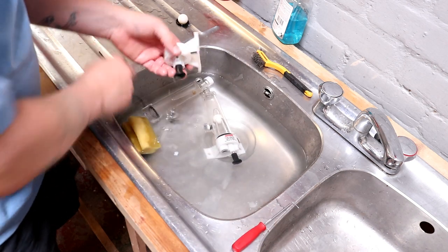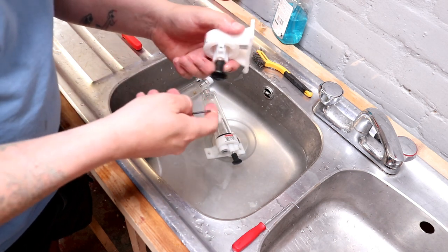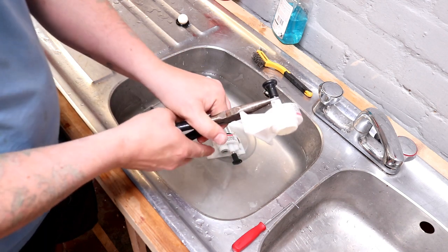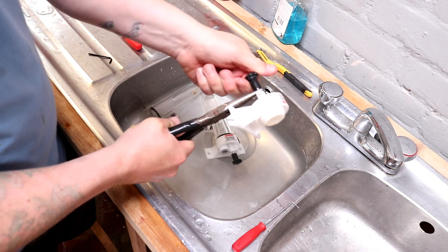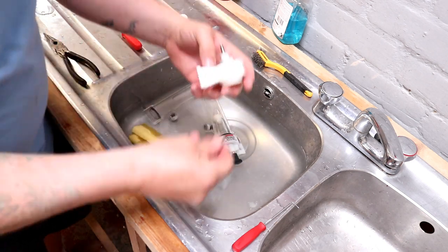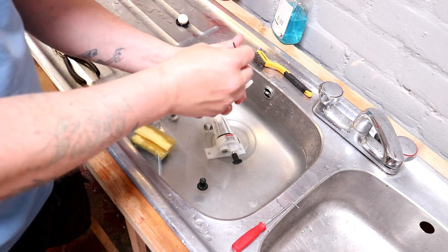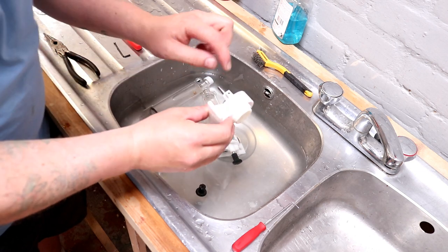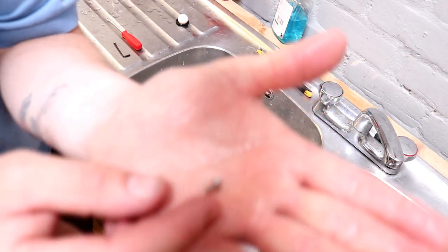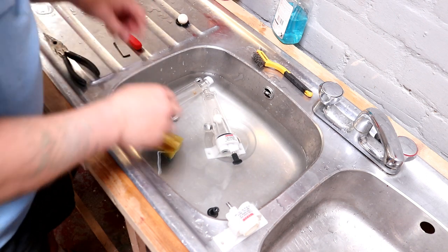And then on this section here, there's actually just a little Allen key bolt in there to remove this. Also, to take the handle off, you have to grab it with some pliers. And to prevent the shaft from rotating, unscrew the handle, just like so. Put that in there. Quickly remove the grub screw from the side. Now, this is the tricky bit — well, it's not tricky, but it's imperative that you keep it upright. Put your grub screw to one side. Now in here there's a spring and a ball bearing. You don't want to lose them little buggers.